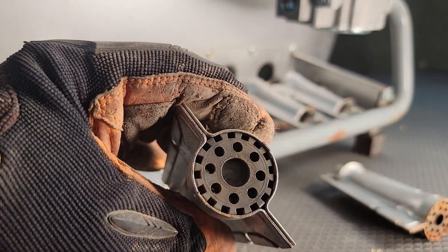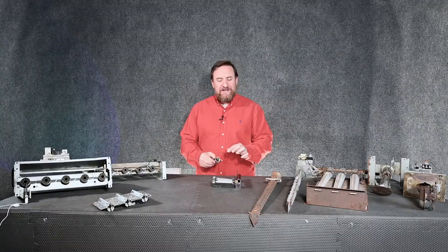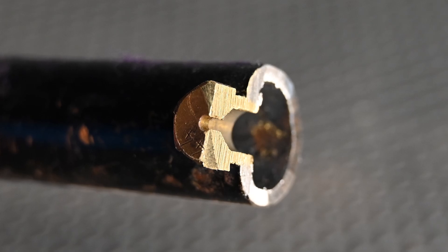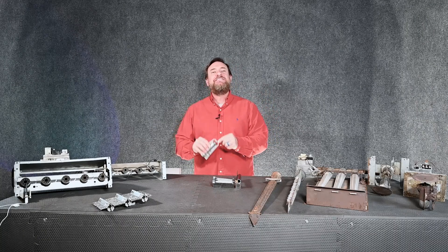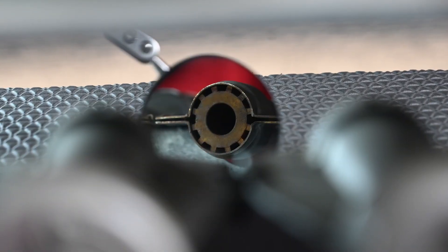So it's essential that we keep the inside of these burners clean — we want to make sure there's no bugs, spider webs, dust, rust, or anything else that can slow that down, as well as the orifice. I've seen before bugs and rust get clogged up in that orifice so we're not shooting the right amount of gas, giving us an improper air-fuel mixture. Keeping that clean is going to be essential.